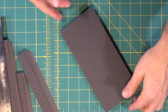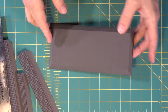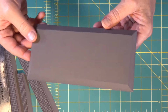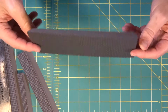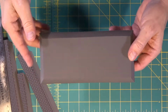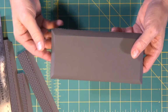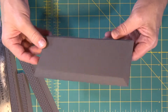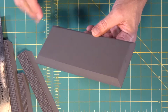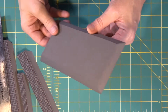Look at that. Now when you flip it over, kapow, look at that bevel cut. Beautiful. Look at that bevel cut, super nice. Now you see why we did the bevel cutting from the back, because we want our bevel to lean in. If we cut from the front and we bevel cut, we would have had the bevel go in the wrong direction. So look at that, very simple, very beautiful. And we didn't need the bandsaw for this because it's very simple to keep your knife tilted at the same angle for all 4 sides.